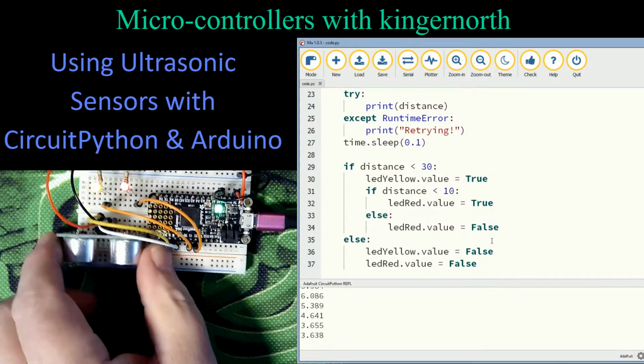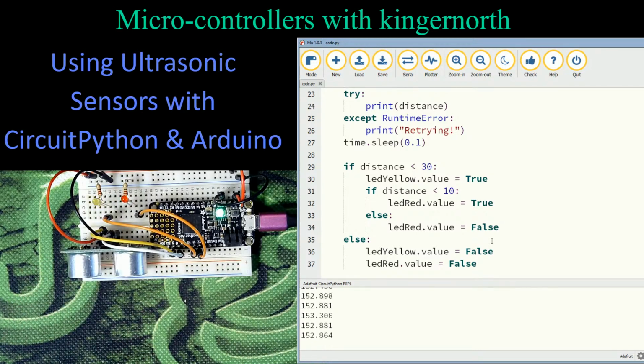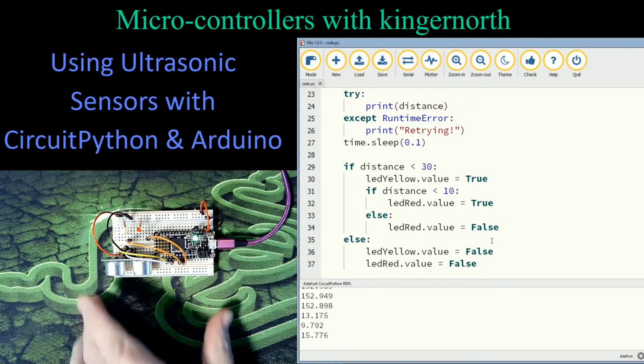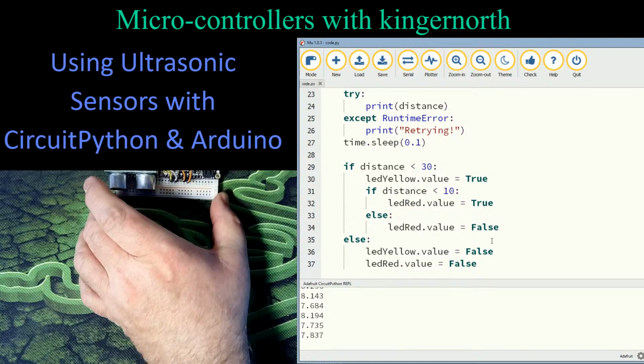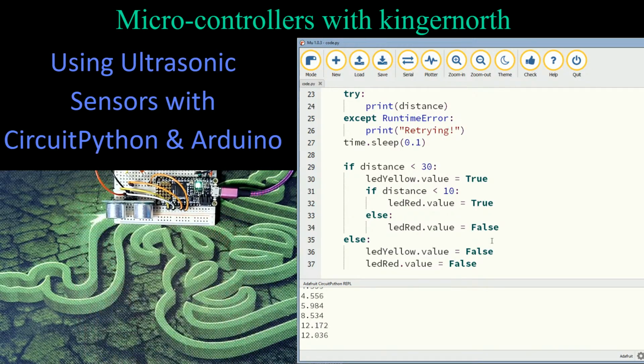And I thought I'd mention this here. The reason I wouldn't use this if I had multiple trains coming in, here I am on my side track. I'm going to try and create as if I'm coming down the side. My hand is not actually lined up in front of the sensor. It's about a track width away. The problem is I'm picking it up because of the angle. I can move out a fair distance. Let's see how far I can show you this. If we zoom out and I move this right to the back edge, I've got to keep my LEDs on there.